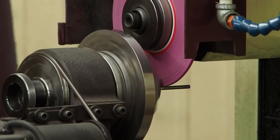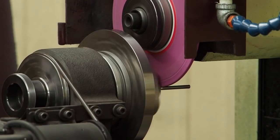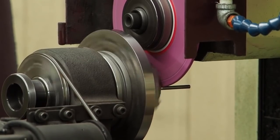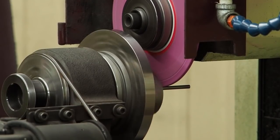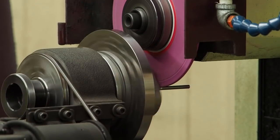And so now, before I would stick up 1.8 inches and I was able to grind 1 thousandth per side. I just touched off. So let's see what we can do. I'll go 1/1000ths. And I rotated that pin 180 degrees, and then I got it actually a little bit closer as far as it's running. It's running a thou out on the front and a thou on the back and almost perfect in the middle.